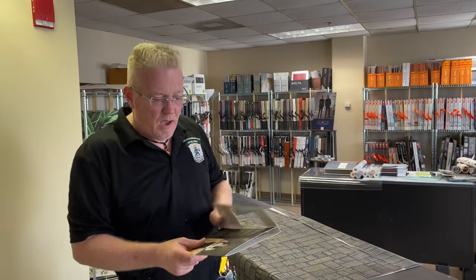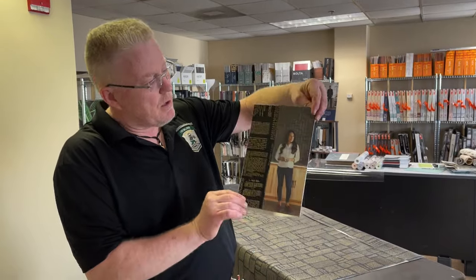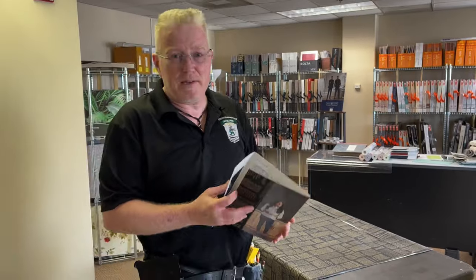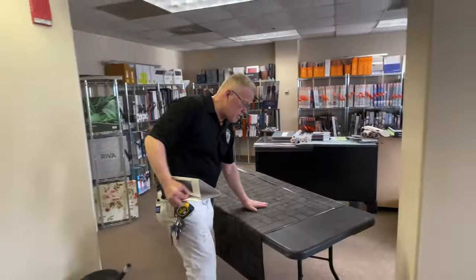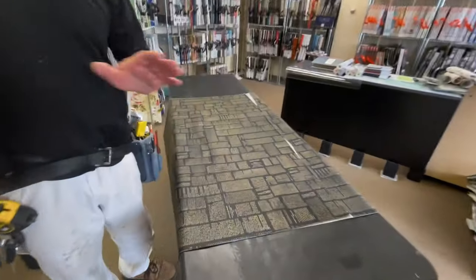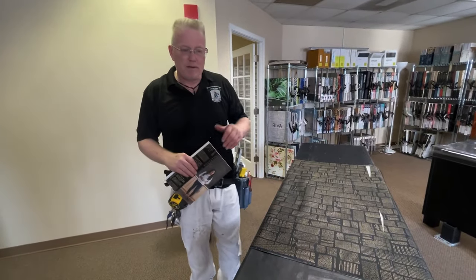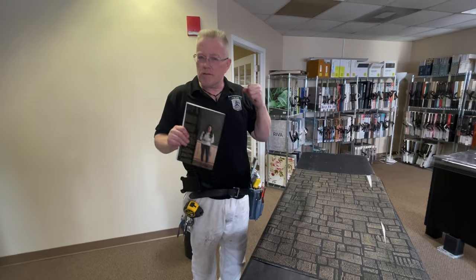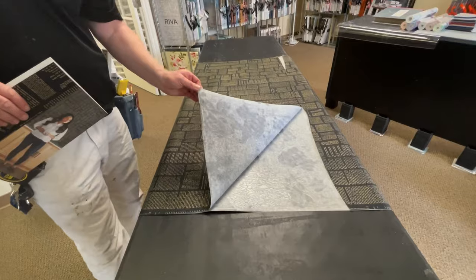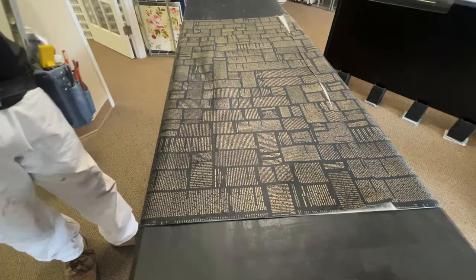Today we're wallpapering the new office in South Tampa. I'm hanging newspaper print by Magnolia Homes. It's a 54-inch commercial vinyl. I gotta tell you, it's one of the best quality commercial vinyls I've ever handled. We're putting it over semi-gloss latex paint, and the paint has been up for a while. It's a strong substrate, and so we put our paste on the back of this spun backing, and we let it book for 10 minutes.